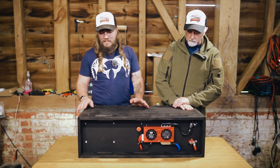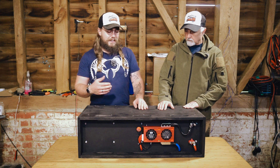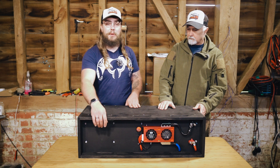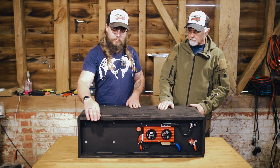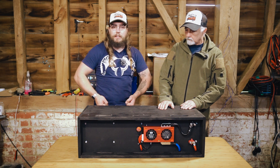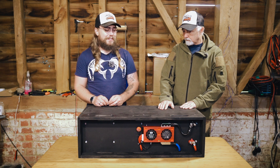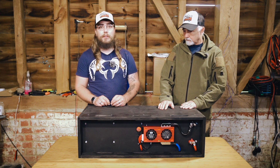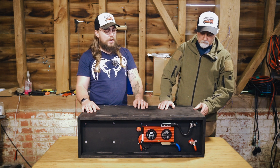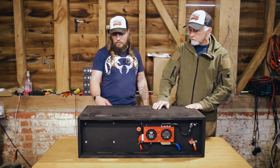The battery is finished and fully built — 18 millimeter ply housing, 16 cells, and a 48 volt BMS. This is a beast of a battery, probably around 100 kilos. We've put in nice rounded handles which makes it easy to maneuver. The idea is that the customer will drop it down into the locker from the top, and we've made him aware he'll need to enlist a couple of strong friends — with three or four people you should get it into the locker pretty easily. There are bus bars on there for connecting loads and charge using M8 lugs.